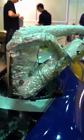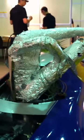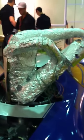On the outside, we see this. But what you see here is not the Stirling engine. It's not the engine itself. It's the burning chamber. Because the engine is working, you have two pistons inside, and one piston is a displacement piston, and the other piston is the working piston. And the displacement piston is heated up by this burning chamber.